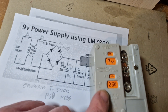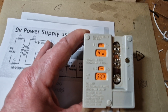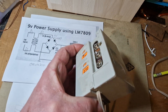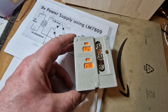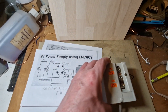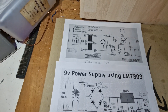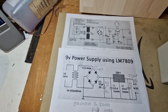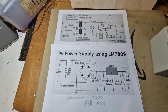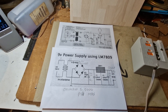When I reassembled it, the windows where the switches were needed to be filled, so there's card inside and I've written on there that it's nine volts DC and 230 volts AC, which is the UK nominal voltage nowadays. It now gives me 8.9 volts output. I know the purists won't like it — I've redesigned it — but I thought let's have something more reliable and get rid of the bits I don't need. It took quite a while, not because the circuit is complex — it's very simple — but just working out how to assemble a completely different circuit on the same circuit board. Anyway, I thought that might be of interest to some people, so thanks for watching and goodbye.